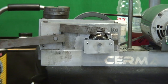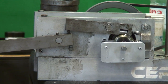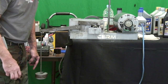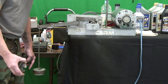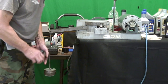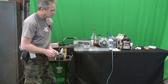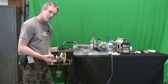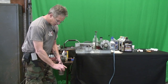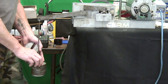As it's generating heat, it's going to treat the metal as well. We're going to rush it here and see if we can surpass where Amsoil went on a clean arbor — on a torn-up arbor. We have two weights now, giving it time to treat the metal because it's a metal treatment, not just a lubricant. Three weights — that's where the second test with Amsoil failed. Four weights, five weights. This is where it failed with Amsoil and destroyed the bearing — and we're at five on a torn-up arbor.